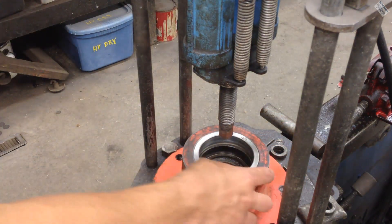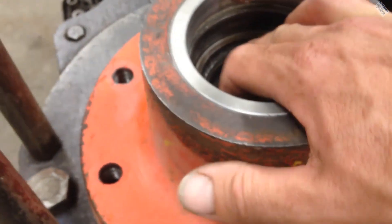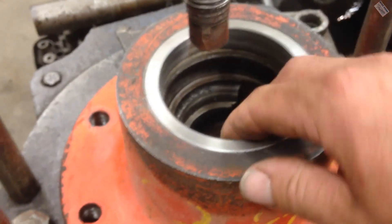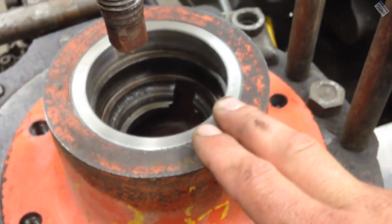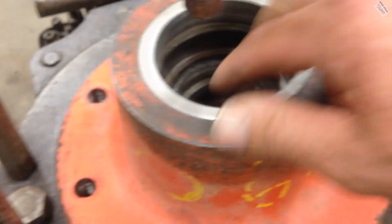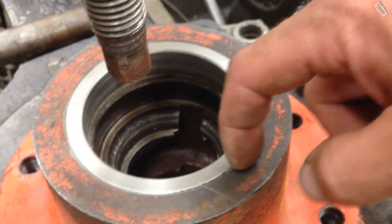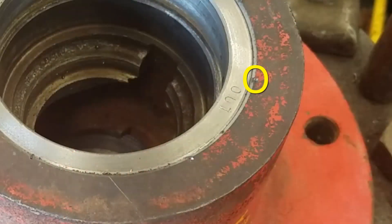It's not coming back out though — that wasn't very hard to press. I've got some burrs down there; I'd better clean those out before I give it to him. I'm very happy with that — the press went a little easier than I was expecting, but it feels really tight by hand and there's no way I'm getting it back out. I'll take a center punch and hit it right here on this line in a couple places — maybe three — to smash the metals together and guarantee it won't come out. Going to bed. Thanks for watching.